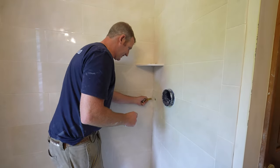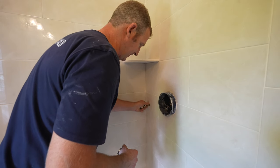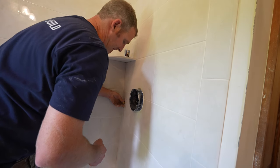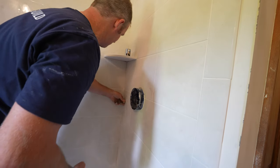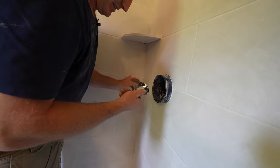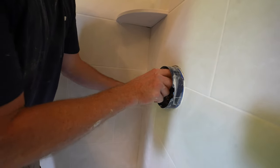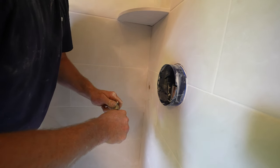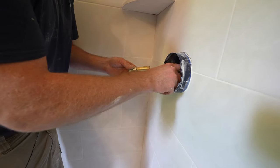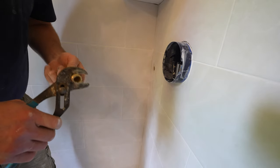Okay, so we got a 2.5 inch brass nipple. Let's see where that takes us when we put it into our port. This one works out. So there's a variance with where we can have this port. That's really nice for a shower port, because we could basically use a 2 inch or a 2.5 inch brass nipple and that's going to work. So we first want to make sure that we address our piping here.